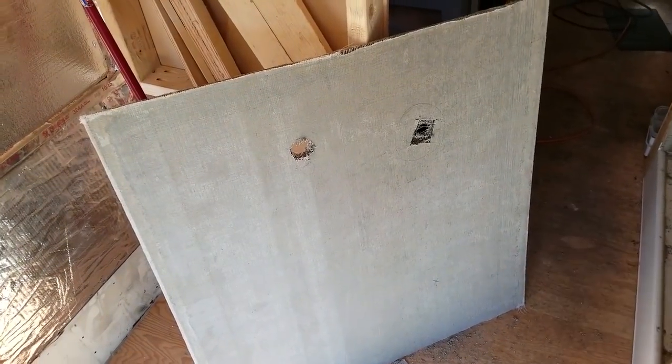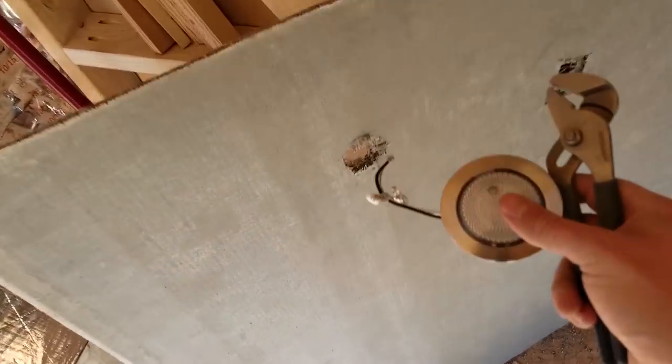We've got two walls in now. This one was cut along that edge and it's kind of rough — you can see there are some gaps — but I'm going to be putting in some caulking. These corners are going to be covered in some mesh tape and then red guard over that, so they will still be waterproof.